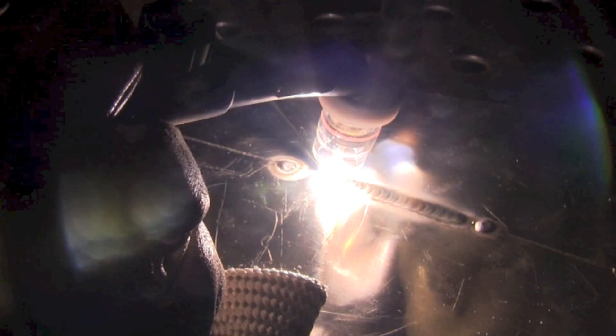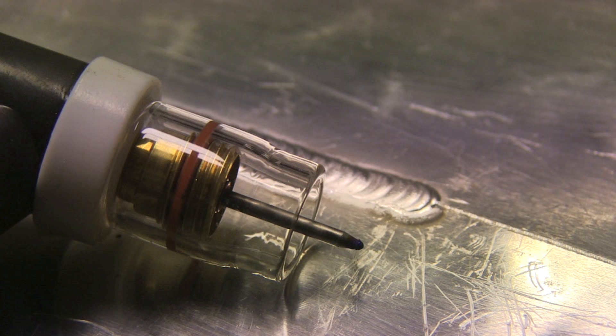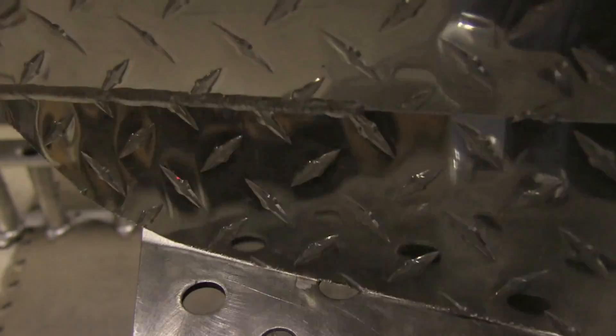You can see the etching zone extending out like it's supposed to outside the bead. The puddle is nice and shiny, wet and clean, and moves along really easily. This is a 150-amp torch as well with a valve on it, even though I don't really need the valve. I probably changed too many things at once — I changed torches, cups, and everything — so I'll have to go back and figure out what the issue was exactly. But this is a Pyrex cup. I don't use them normally for everything, but it is good for filming. It lets you see all the way inside to the tungsten, and if it's remaining silver, you know you're at least not in too bad a shape on your argon shielding.